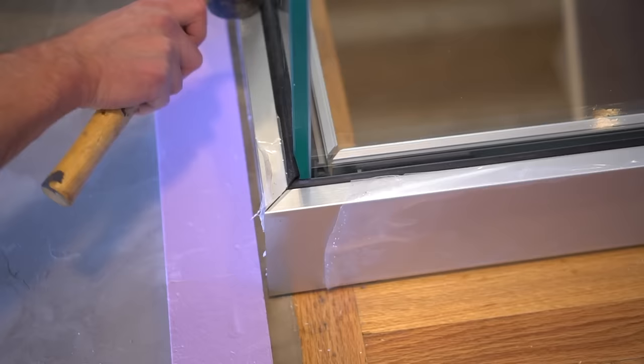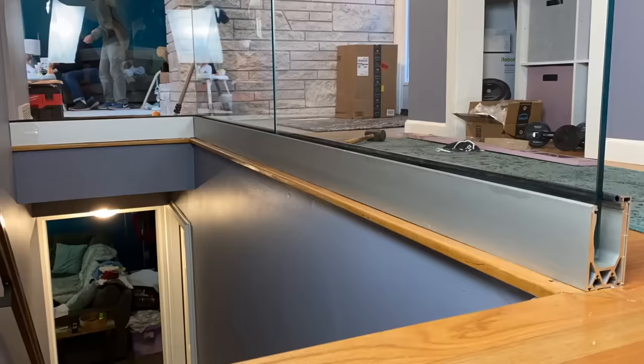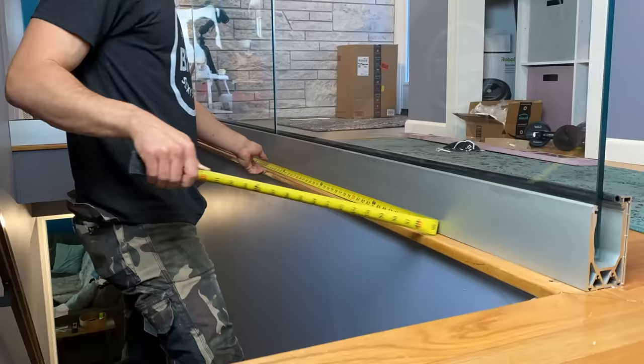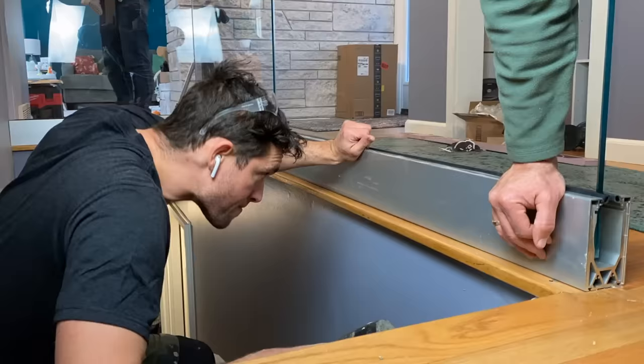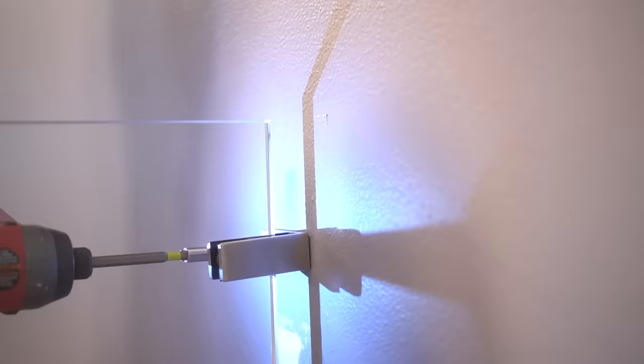If you cut too long, you can always take a little off if needed. I also suggest grabbing a rubber mallet to make it a lot easier to get these pieces in place because they fit quite snug. Also, the directions do state that the cladding on the oval side should be installed before the glass — yeah, I did not read that. I'm sure it would have been a lot easier to install on a flat surface than in a stairwell. Once we have the cladding fully installed, I then proceed to installing my last bracket that connects the glass panel to the wall.